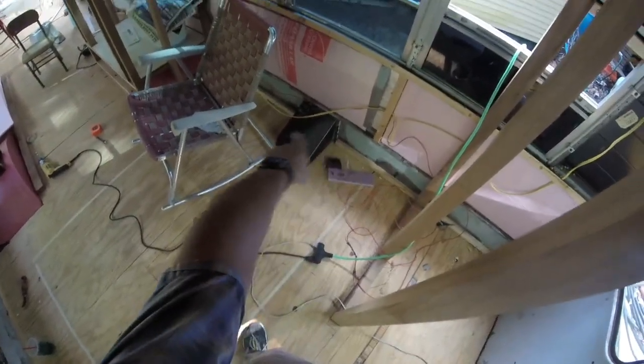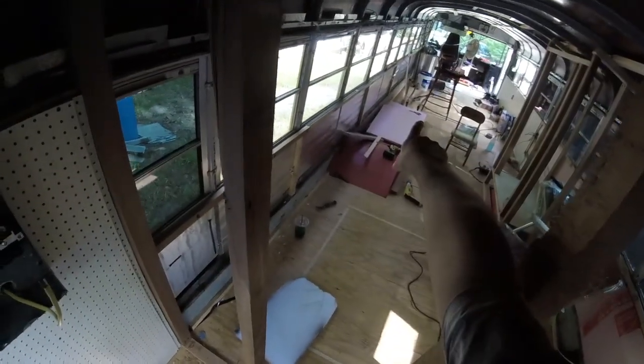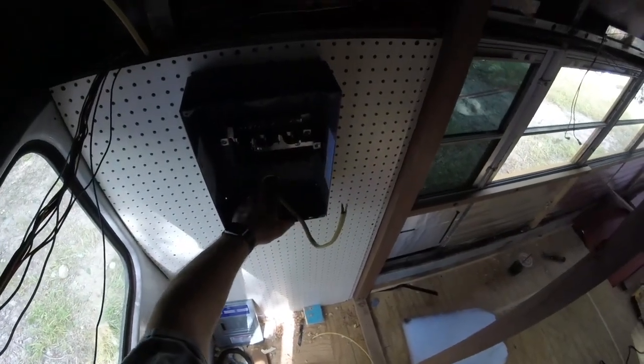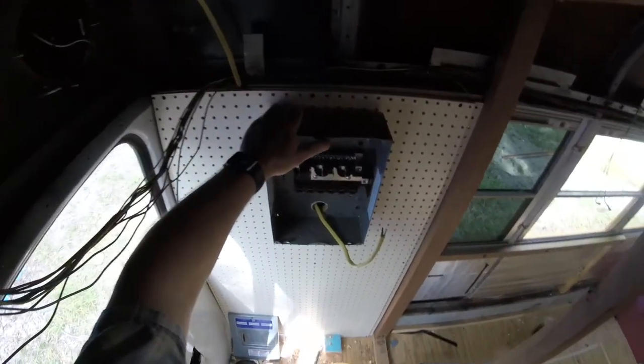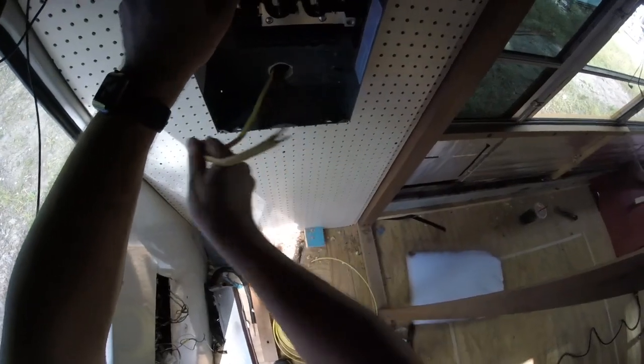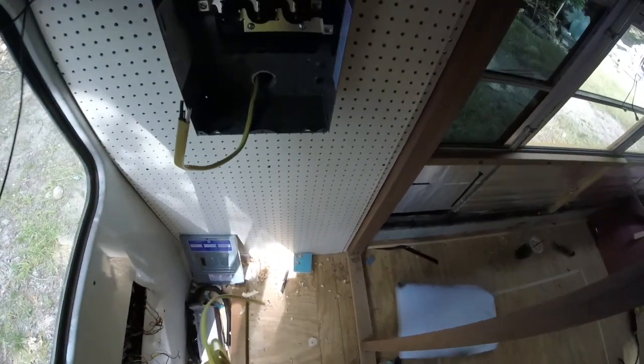You can see I got the wire run over here. I left extra at every place I'm going to be putting an outlet in, and then I'll be fastening it to the wall. I just want to leave a little extra so I had plenty to run up overhead and get it over to the box, then I can run the one up this side of the bus. The solar stuff will be on the outside here and then attach into this to get our 110 eventually. But right now I just want to run some more wires, so I'm going to feed this one through here.